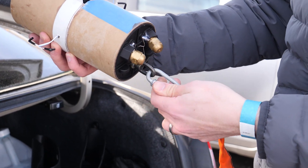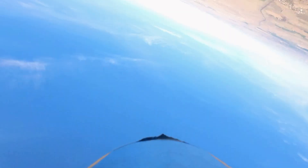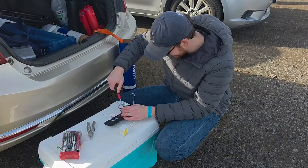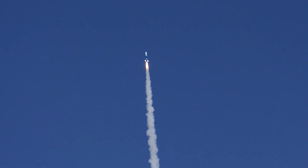Starting with ejection charges — they worked great. I was a little on the fence about the design even after all the testing, but they're operating fine. I've shot them 10 times now, they have a 100% success rate. They're on the small side for my drogue separation because there's a lot of volume in that rocket, but they did deploy. The altimeters also worked — all four charges fired at the right time. They were a little annoying to install at the launch site, but that's just quality of life improvements for next time. The only problem with my dual deployment setup, aside from the obvious, was that I undersized my drogue parachute. The rocket was coming in nose first, so when the main parachute opens, it whips past and creates a ton of shock. Ideally you want your rocket coming in flat. And the motor looked fantastic — the rocket took it like a champ. For the next flight, I'm probably going to move up to a higher thrust motor, just to keep things interesting.